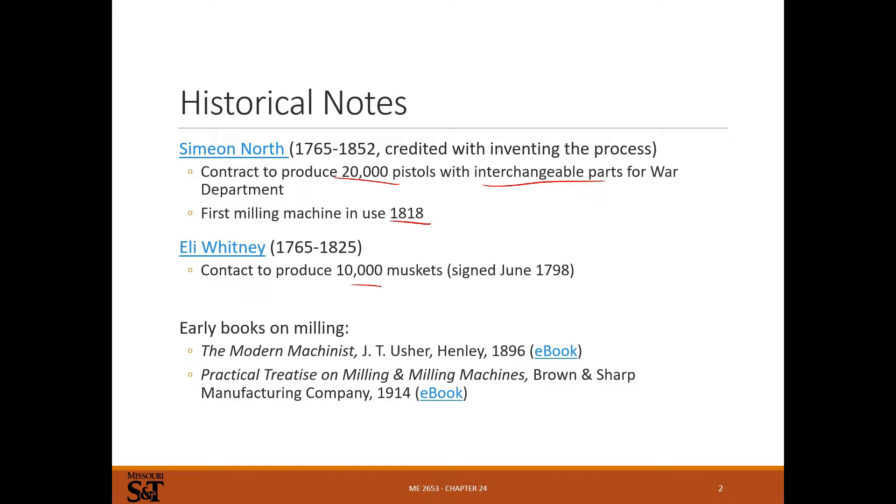The main difference between turning and milling: in turning we're turning something that has a circular pattern, a revolved profile. In milling we're usually making flat surfaces.